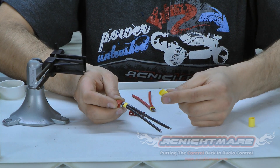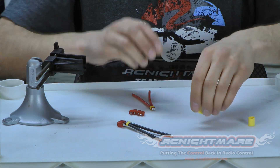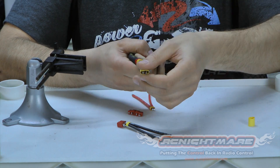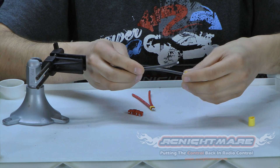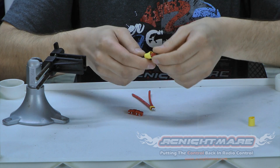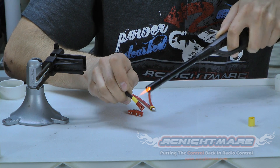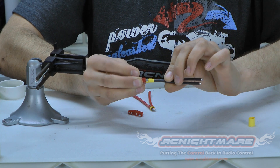Now we can take an extra piece of shrink tubing and put it over the top of both of them. If your shrink tubing isn't quite big enough, here's a quick simple trick: take a needle nose pliers, slip the shrink tubing over the end of it and just stretch it out a bit. Not too hard, but give it a few stretches — it'll still shrink up to the same size but it's a little more expanded so you can fit it over the top. Because I have so much wire to cover, I'm going to help hold the shrink tubing as I shrink it so it really gets over the tips of the wire. That's it for the negative — pretty clean.